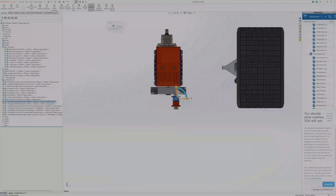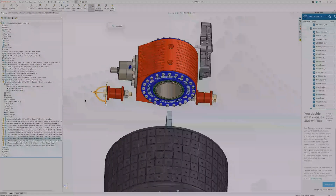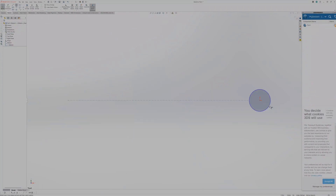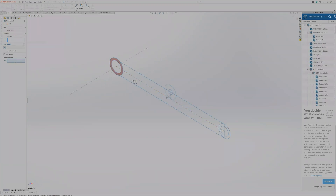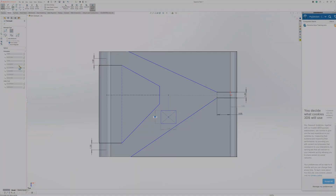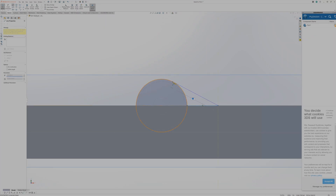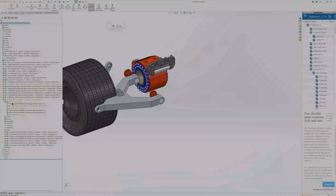The first thing I need to do on the front suspension is drop in all the mounting points. On the lower control arm I'm using polyurethane bushings with bearing bronze sleeves for load bearing, since it's only pivoting along one axis. I need to map out the dimensions between the upper control arm and the pivot point on the chassis center, make holes for all the hardware, and figure out where the shocks mount. I'm starting by making a flat plate extruded outward and cutting around it — this wishbone-style A-arm is laid out from the top to get my head around all the dimensions and mounting locations.